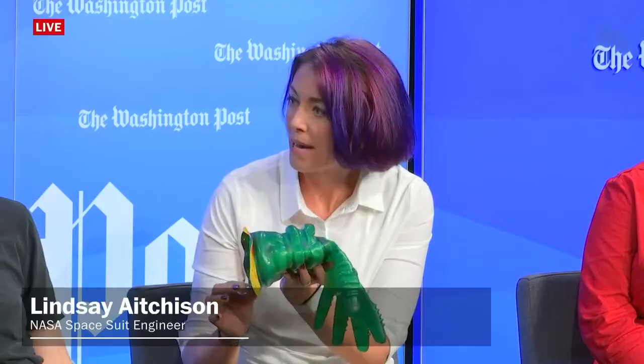How does it seal? There's a bearing that goes into the bolt hole pattern here, and that connects to the lower arm of your spacesuit so it swivels around and you can move your wrist. On top of that you have what we call the restraint layer — that's the part that keeps the shape of your glove and provides mobility. You can see the rings that allow your wrist to rotate and bend back and forth, and each of the fingers are sizable, so everybody has a custom glove.